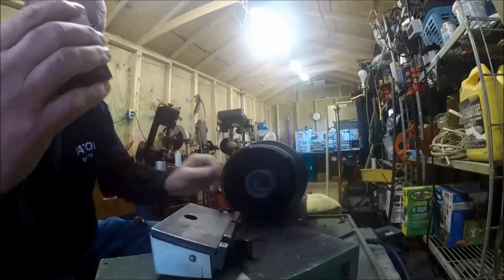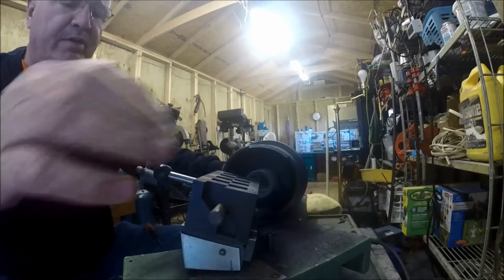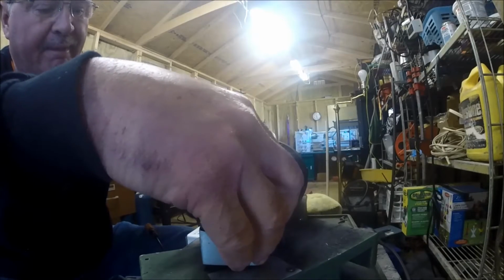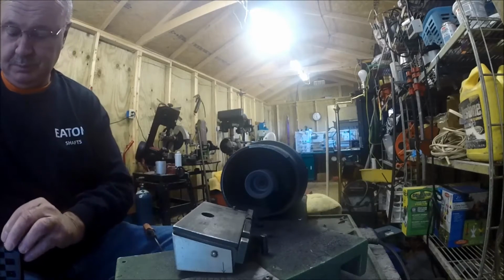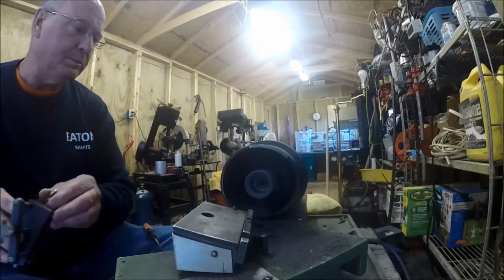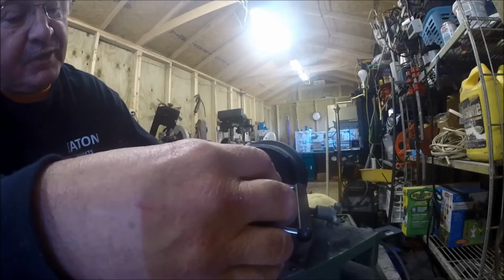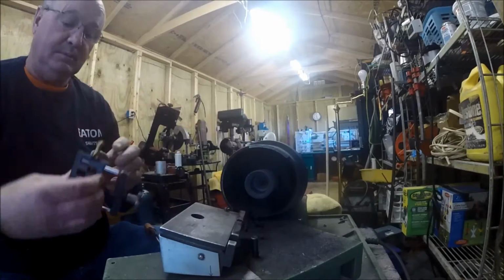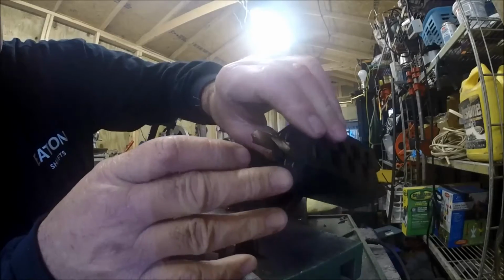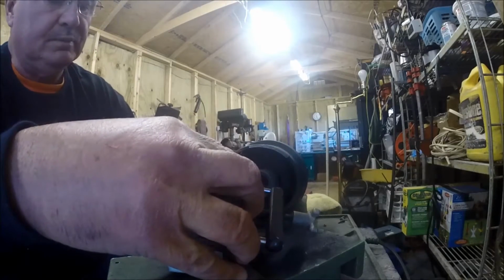This drill is one that I was using to counterbore my collet plate. So it's going to be noisy. So let's hold on. Folks, I like to be careful, you've got to get the right back relief in these drills. So it's a lot easier to see. If you'll notice this one, I don't know if the camera will focus, but you see how this is coated; where I'm starting, that's where we're going to start from. Ensure the correct relief.